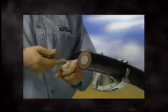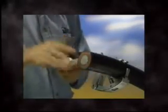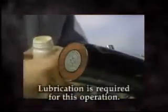As an added bonus, this tool will also end strip insulation from medium voltage cables in much the same manner as outer jackets. It is especially useful for softer EPR insulation removal on large conductor sizes. It is recommended to leave the semicon layer on when stripping EPR.